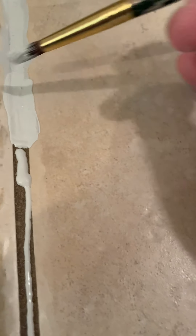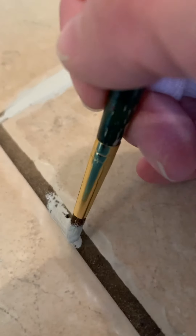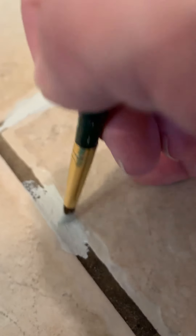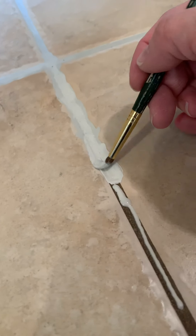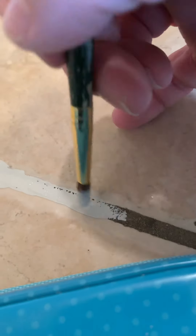There's so much paint on the brush so I move to a spot that doesn't have as much. You just wipe it — see how it's thinner on top? You want to keep it thick inside the grout line but thin it out on the top of the tile so it's easier to wipe. I come back over and rub it down, then go to another spot and brush back and forth.